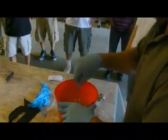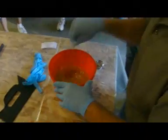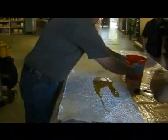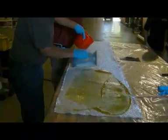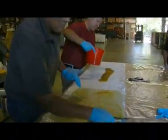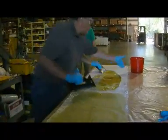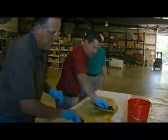Once it's mixed it's ready, so you don't have to put a lot of energy into it — just do it very, very steady. If you're working on bigger diameter pipes in hot climates, you've got to work the packer accordingly. Using the spatula, just even it out on the surface.